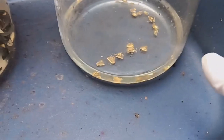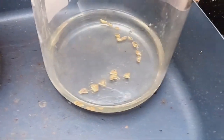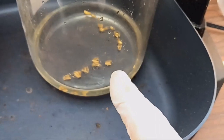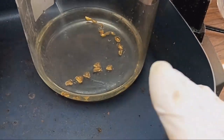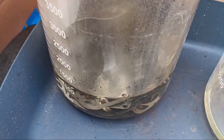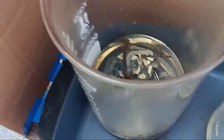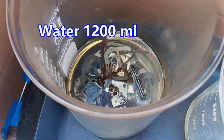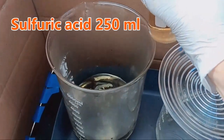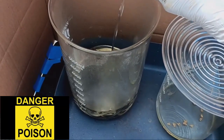When my solution is ready for precipitation — to drop gold from it — I will use iron sulfate today. I don't want to use sodium metabisulfite. To dissolve this amount of gold I need 3-4 hours. And to make iron sulfate, I need 3 hours too, so I want to make iron sulfate right now. 120 ml of water, steel, and 250 ml of hydrochloric acid. Danger — very dangerous acid.